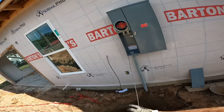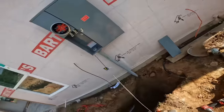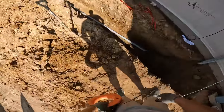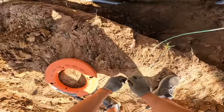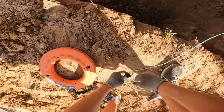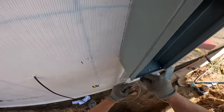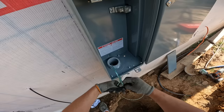Slim went to the other end and tied on a string, then here's me pulling the fish tape back and rolling it up. We'll pull the fish string back out and tie it off on both ends so it doesn't go down into the pipe. He'll cut it on the other end, tie it around the pole and secure it, then put tape over the top of the conduit going vertical up the pole so objects don't fall in there and clog it. You need to keep a clear pathway so the utility can get the wire in — just keep it clean from debris.